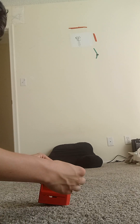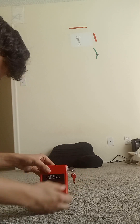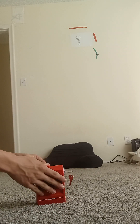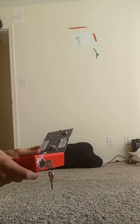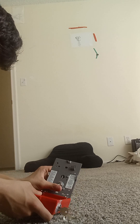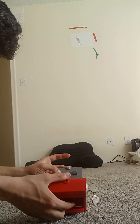Let's read the inside of this device. To go to the inside of the unit, get your keys and open it. After you stick your key in there, you open up the device and turn it and open it. It will say 'to test, remove glass rod,' which means basically when you pull it, it will break the glass rod. Make sure to pull the lever to normal. Basically when the pull station is pulled, it will activate, and to reset it you flip down that switch.